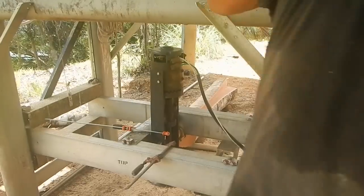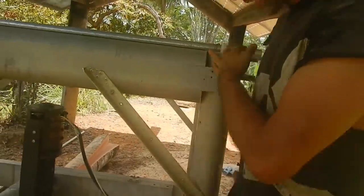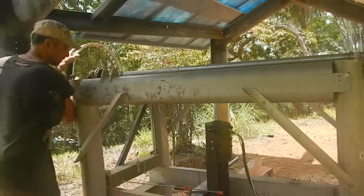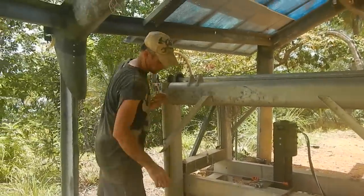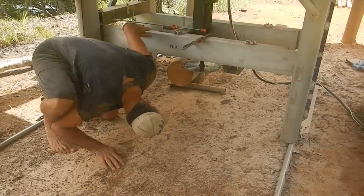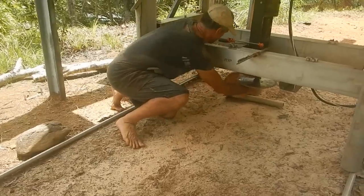Okay, right now I want to raise it up a bit. I have to raise it up enough to get that bolt clear. Right? Yeah. It'll be really good to know how many spokes it takes to get that bolt clear. 1, 2, 3, 4, 5, 6. Maybe 7, 8. All right, remember this, humans. I think 7 will actually do it, but if I go up 8 spokes, the bolt under the blade is totally clear. Let me just make sure it's still tight. Good.